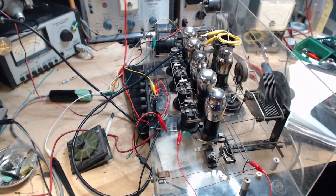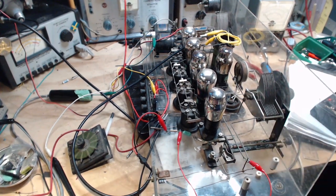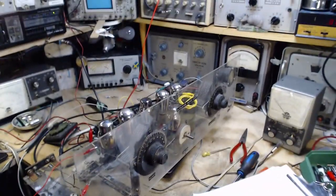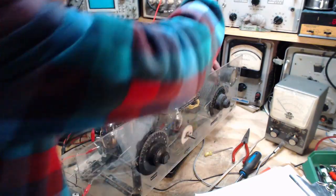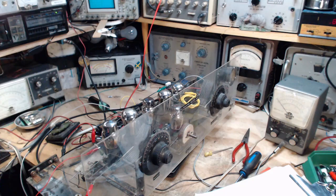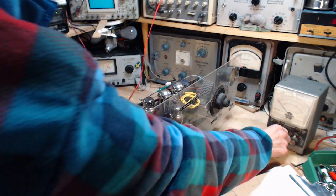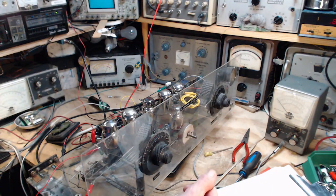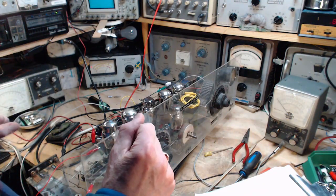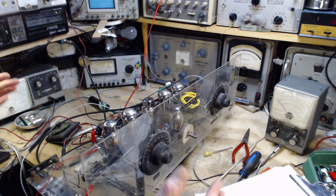Okay, I think I'm ready to operate here. First stage is to turn on the heaters. Get these tubes warmed up. Okay, so I have to break the connection here. Okay, and then bring on the power supply. Check the voltage. It's good. This is reading B+, I believe. Before, yep. So we'll keep using this. B plus is about 50 volts, 45 volts.